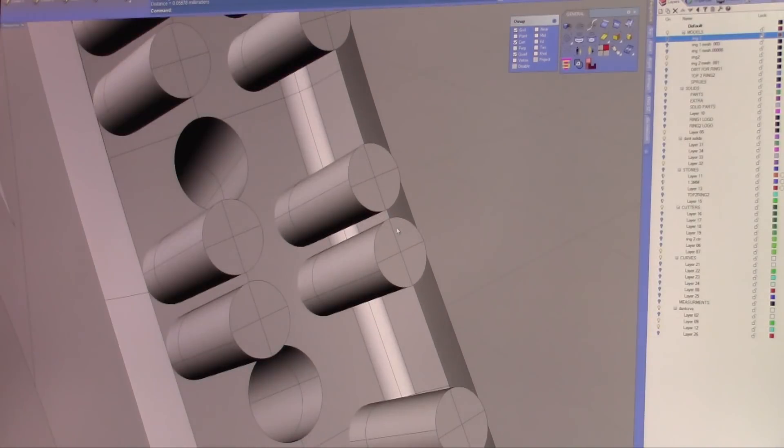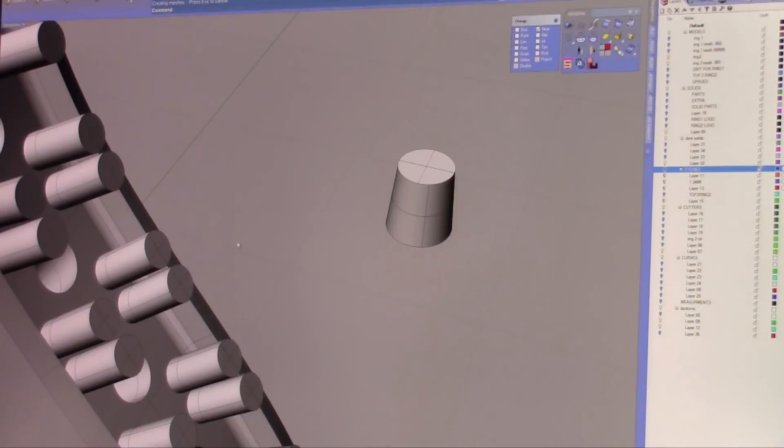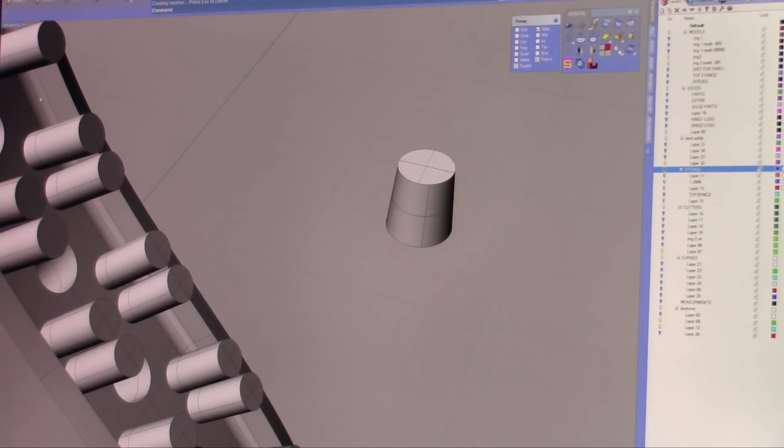If this was done correctly — if your tolerance between the prongs was half a millimeter, or if it was 0.1mm on the bottom point and tapered up — you make that tapered prong, give it the drafting that is needed. As it comes up it becomes heavier, and that opposing pyramid shape is going to hold it and not let it flake off.